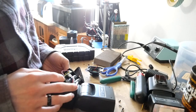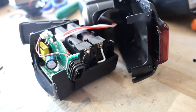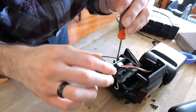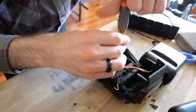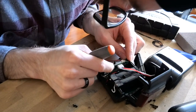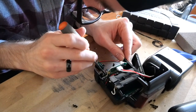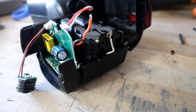Moving on, the second iteration is a bit more obtrusive. I ended up taking the flash entirely apart — and keep in mind, both of these flashes I'm modifying are the newer TT 560 speed light. Taking it apart, I was trying to find the leads that go from the battery compartment to the main board, which then charge up the capacitor.